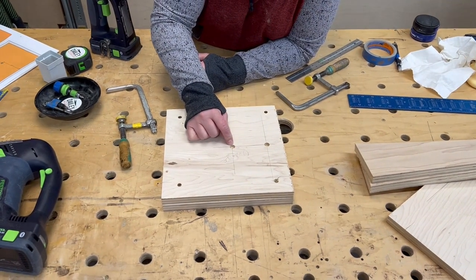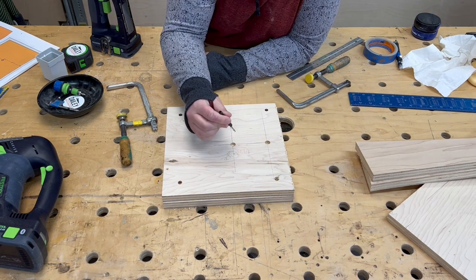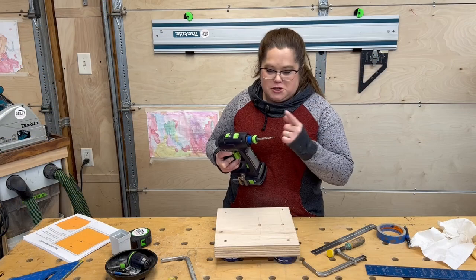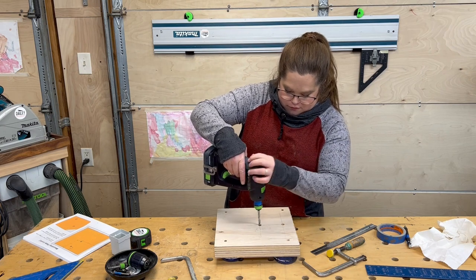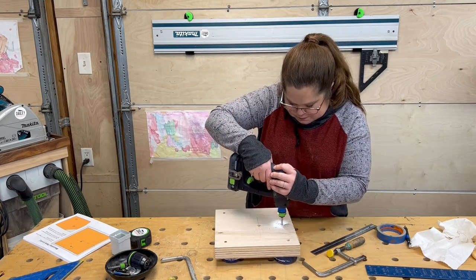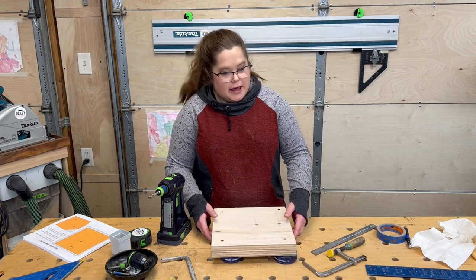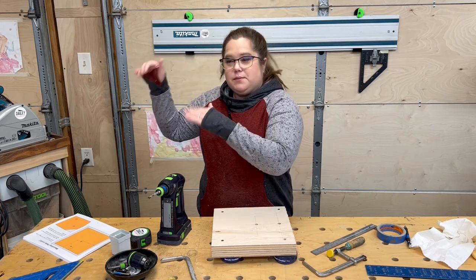Using this center little poked-out part, we're going to line up the quarter inch bit at that center and then drill through all the way to the other side. This quarter inch bit has the pointy bit here that I'm going to put in the part left by the pointy bit of the other one. From this side we've got the larger holes and from this side we've got the smaller holes. This is exactly what we were supposed to do, and this will fit the quarter inch by 20 hex head bolts that are linked in the plans and description box.